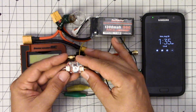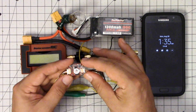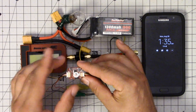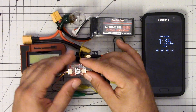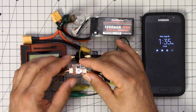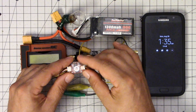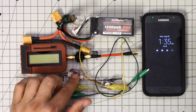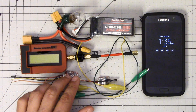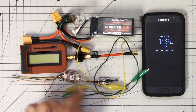The output power shows it's designed for racing. A freestyle transmitter you'd probably want a bit more transmit power, because you're flying more by yourself and have more obstacles to punch through. For freestyle I'll often use 500 or even 800 milliwatts. But for racing, 200 milliwatts is more than enough, and you're often running at 25 milliwatts to minimize interference between pilots.